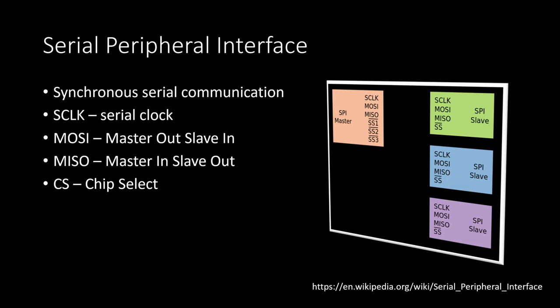These other devices are often referred to as SPI slaves. There are really four signals I'm going to be working with: a serial clock that the master generates so slaves know when to read data; MOSI - what information the master is sending out; MISO - what the slave device sends back to the master; and chip select - which slave device am I going to activate. Only one can be active at a time, and that is controlled from the master.